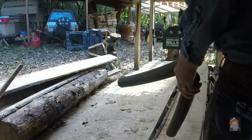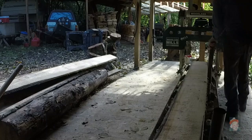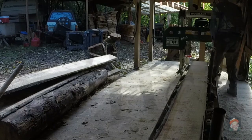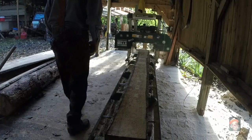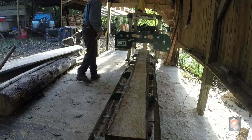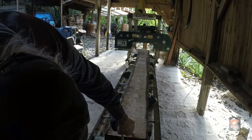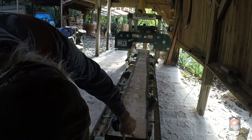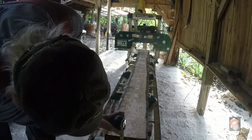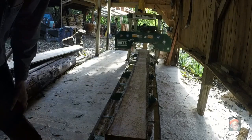The cant is short enough that I don't really need the plastic pipes to roll it. I could have raised the stops instead, but slipping on pieces of plastic is a lot faster. I'm going to make all of this 3/4 siding. No, I'm not. I'll take 2 3/4 off of here, roll it, 1 cut off of here, and 3 3.5s, roll it, 15 or 18 2x4s.